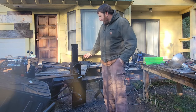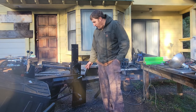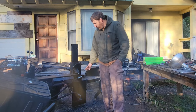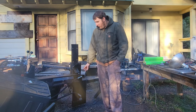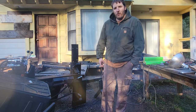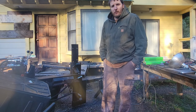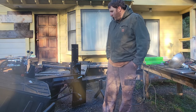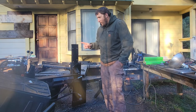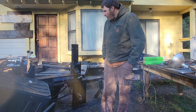And I tested out the wedge obviously earlier. Everything works great. A lot of control in the wedge. This hydraulic's a little overkill for this setup, but I was hoping by having a larger hydraulic, I'd have to push more fluid in there, so it'll give me more control overall and I wouldn't have to put a reducer on the flow. So it works really great for that, and it's going 1/2 inch to 3/8 also, so that's going to slow the flow down a little bit.